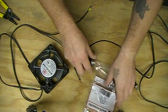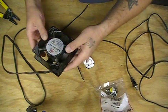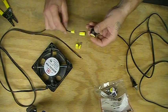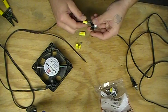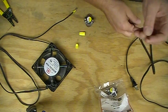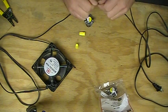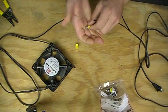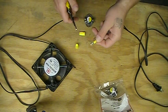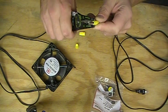Initially all this is just a big spring in there, and when it gets hot it closes and opens and creates a circuit. This is gonna represent our big blower fan, and all you're doing is creating one big circuit. It's got these little wire connectors that go on there. You just take a couple of these and put them on one side of your switch. This is your actual plug. If this is gonna be outside, you're gonna use a weatherproof box and seal it all up. You can pick these up on eBay or Radio Shack — just a little connector. Then you use the crimp tool to crimp it down.